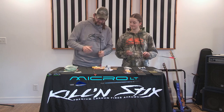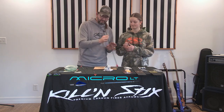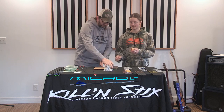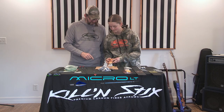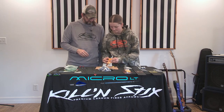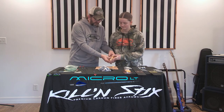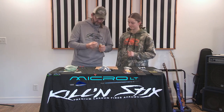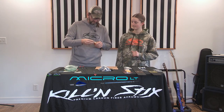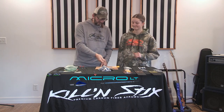We haven't mixed up this epoxy yet, so take the lid off. Squirt a little on the cardboard here — there are two parts. Pull back on this to stop it from running out and put the cap back on. Take your nail or whatever you want to use, mix it up and stir it.